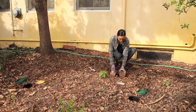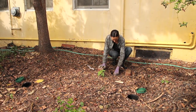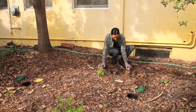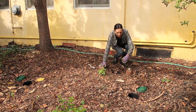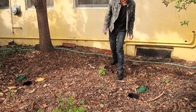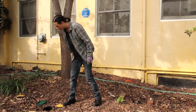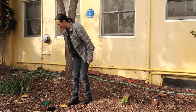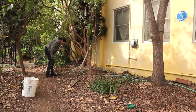I'm going to open up the flow splitter. This is where the water is divided, and this is a good place to check and see how water's flowing. This has a little clean-out in it and it looks good — there are no obstructions, I can see the water flowing. Let's check the outlets. It's coming out there, and there. I'll check the other two — that one looks good.